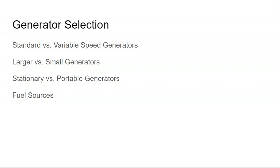So does that mean you want a large generator and a small inverter? Well, you could, but you'd want to isolate them. You'd want that large generator there to power the whole house if something's going wrong with your solar array. A smaller generator has its own different issues. You don't want the generator to be too much smaller than the solar array battery inverter, because you don't want the battery inverter to be outputting so much power that it's overpowering the generator.